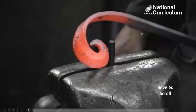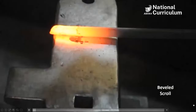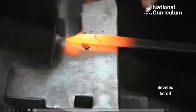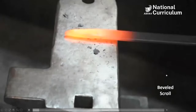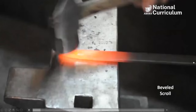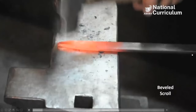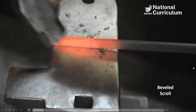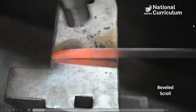I'll show you a little video here of how this is done. This is kind of the final shape. Short taper — you really have to start at the very tip, otherwise you don't get it that short, and you need to hit it hard. Correct for the width and for the thickness of the stock. Try to taper in one dimension and keep the thickness the same everywhere.